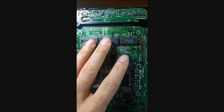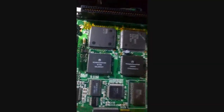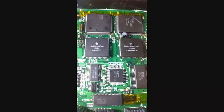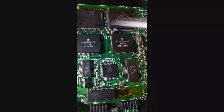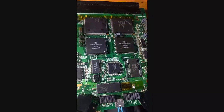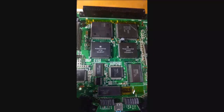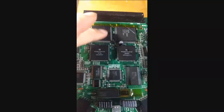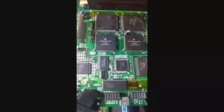That sound chip is the 315-5476A right here. The FM was totally messed up. When I opened it up, the first indicator of a problem was pin 104 on the 315-5632 — right on the very edge — was bad. That pin goes to the 68K, specifically around pins 40–45 on the 12 MHz 68K that drives the Sega CD ASIC. When I lifted the pin on the 68K I saw no short; it was only a short on the Sega ASIC. That address bus is partly responsible for PCM audio, so if that pin is bad, your PCM audio is definitely going to be bad.